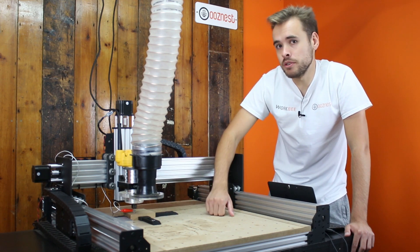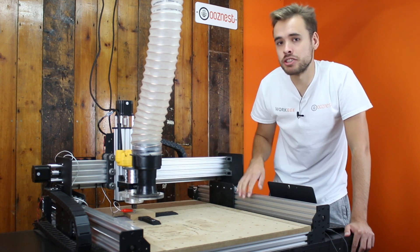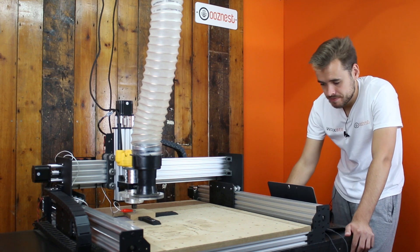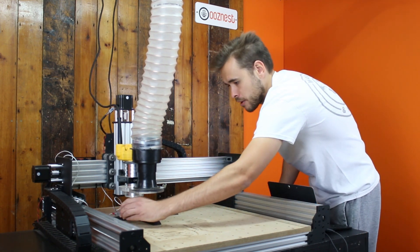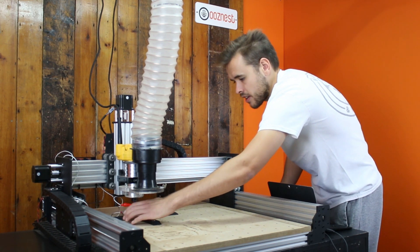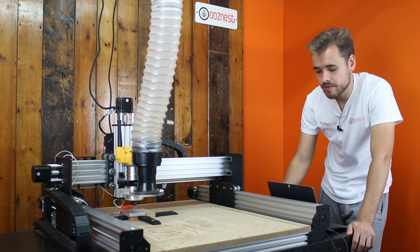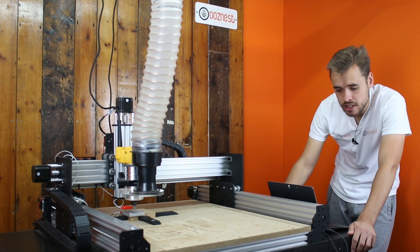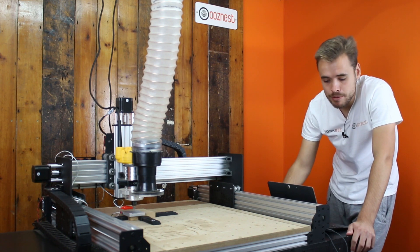This touch probe can also do X and Y and Z altogether. So what I'm going to do is just move this back up and demonstrate running the XYZ touch probe. Put the touch probe back, just located in that corner, and just need to drop down the Z another 10mm. Now I'm going to press number two because it's an eighth inch bit under the Macros.